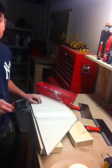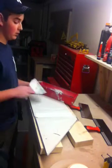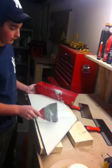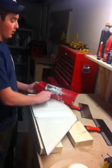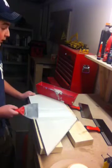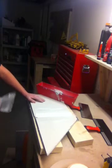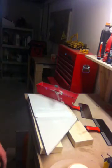You also want to clean off your edges, and what I mean by that is you don't want to leave it like that, because you won't be able to take that off. It'll be hard to sand. So anytime you get something on the wall, you just come by and swipe it off. Same thing here. When there's too much mud sticking up, you just swipe over it and clean it off. Otherwise, the finishers will have a hard time making the wall surface look smooth. So cleaning off your edges is important now so the finishers don't have any troubles after that. Okay, so that's the basics of taping, and I hope your project goes well.